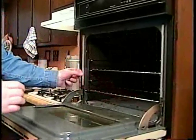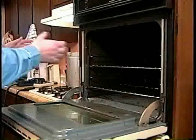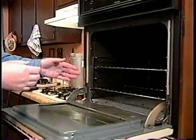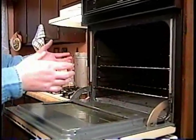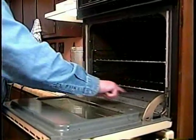In this oven, you can see these little air holes — these air vents. The way a gas oven works, whether it's a wall unit like this or a standard floor unit, is the air comes up from underneath. But these holes are blocked, and you may find that pretty common because a lot of folks put aluminum foil down here. If those holes get plugged up, there's not enough air coming through and you can get high carbon monoxide. Before you turn the oven on, you want to make sure there's not a lot of things stored in there.